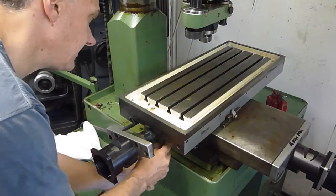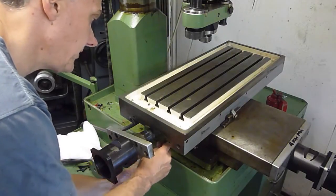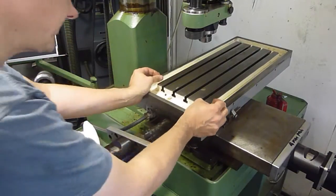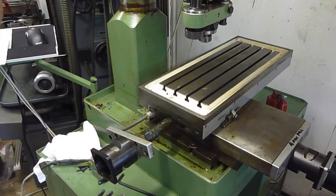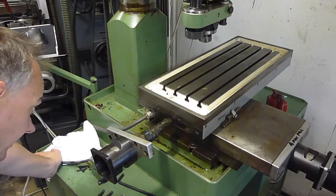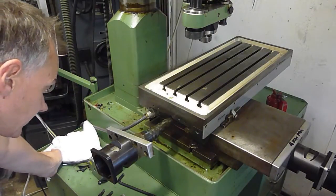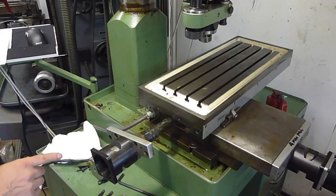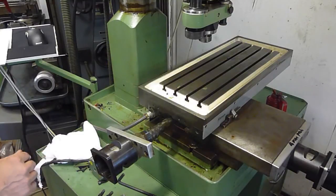If I remove that screw, the table will go back further. It's very slightly tighter when you go beyond where it's been moving, which is only to be expected - it's been wearing away. That's still hitting a stop; I realise it's the stop on the front of the table. What I'll do is bring the camera down and show the pillow block for the table, describe how it works, and then pull the feed screw out for a closer look.